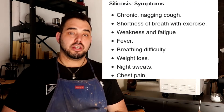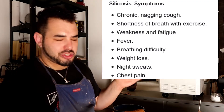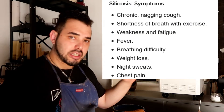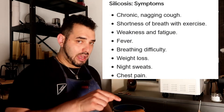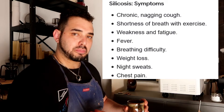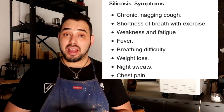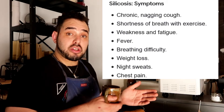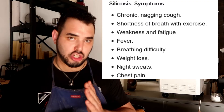If you sweep, that silica and clay dust get into the air and not only ruin your work but end up ruining your lungs if you do it too much. Here are some of the things that happen if you get silicosis — just some of the symptoms. This is just from silica getting into your lungs, not from the chemical doing damage on its own. As for the actual clay substance itself, whether you're breathing in copper, silica, or something else, the chemicals themselves cause an entirely different kind of damage depending on what you're breathing in.